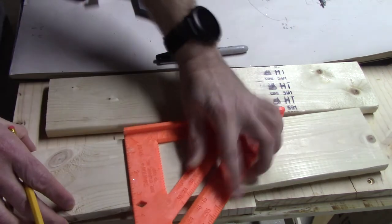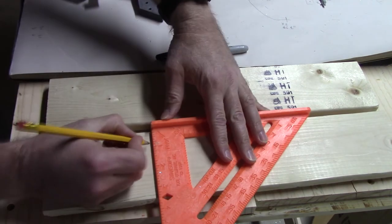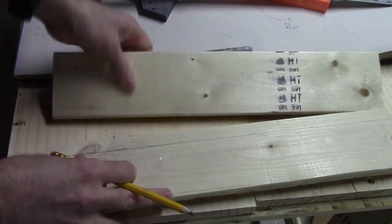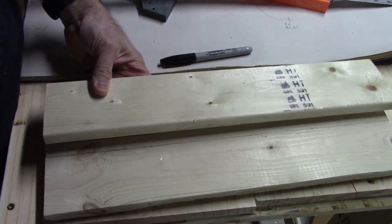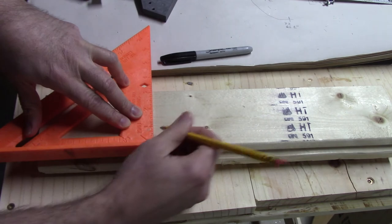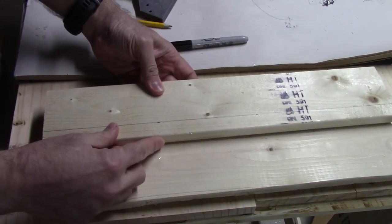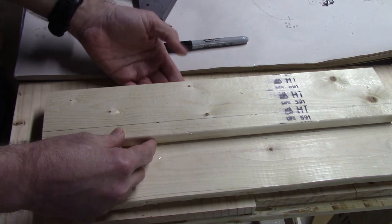I'm going to make a few 0.75-inch marks along here, and then the same marks on the other board, so I have an actual guide for the saw to know where I can't cross — if I cross that line, bad things will happen. Then I'll do the reverse process 0.75 inches on this side. During the entire cutting process, this board will sit on top of the other one, so let me get another scrap one-by-four to put underneath while I get things assembled.